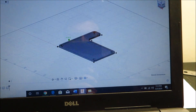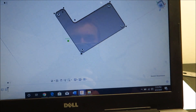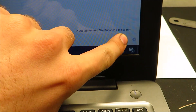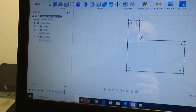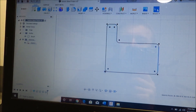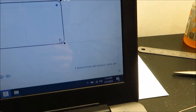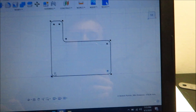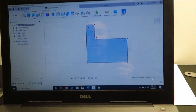I created this drawing. You can see there's a thickness, there's holes, all that stuff. I clicked on these two points right here and you can see the distance is 160 millimeters. That's just a point for the radius — not a bolt hole. That point and that point is 90 millimeters. This point and this point is 175 millimeters. So those are the measurements.